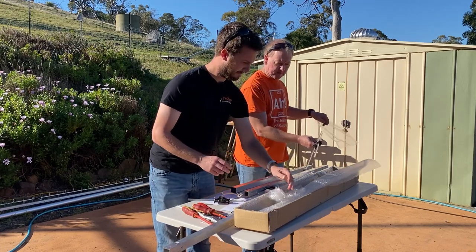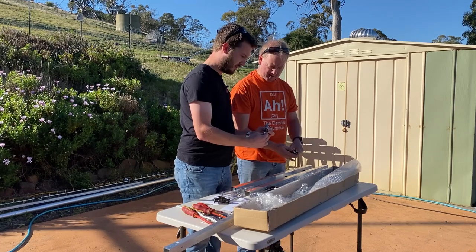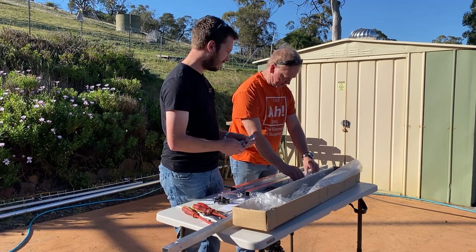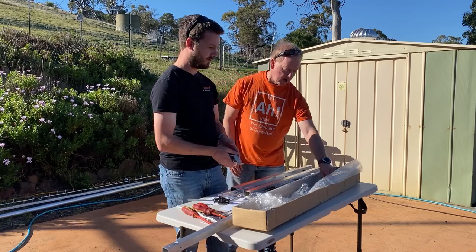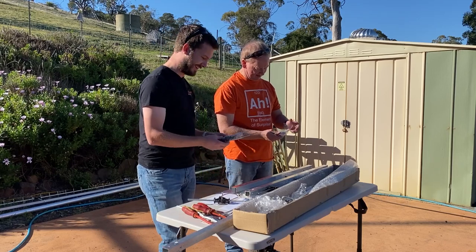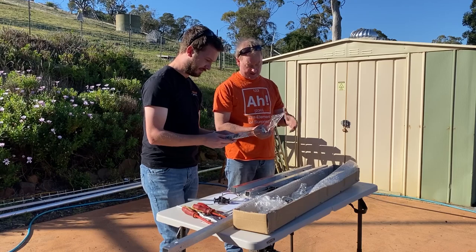Nice boom. On the clamps, he uses nylon nuts so that they can't come loose, especially under vibration. That's a big thing when it's blowing and windy. Nuts can easily come loose and fall off the antenna, and then your antenna falls off. As I well know, with the antenna that fell off at Mount Lord. It was pretty windy up there, to be fair.